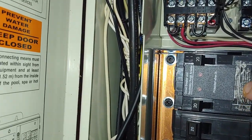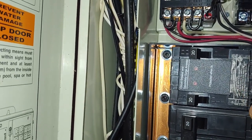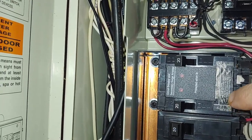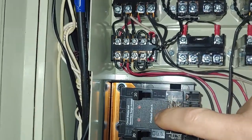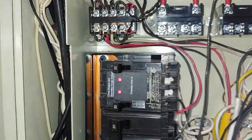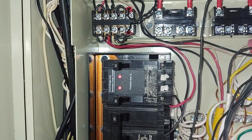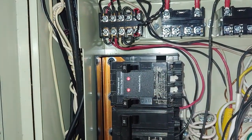This is a Siemens device — made by Siemens under the Murray brand name, though I think they may be phasing that out. It's the same type of protection as the other one, just so much easier to wire. You can also see at a glance that it's protected because it's lit — both legs are protected. This could also wear out if it took too many hits or surges, so it's good to confirm protection at a glance.